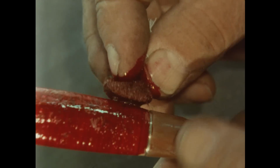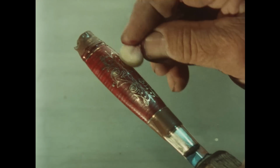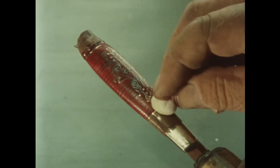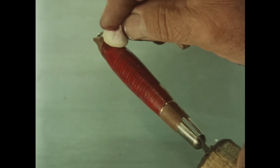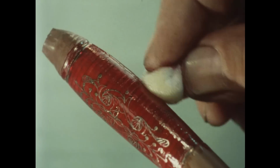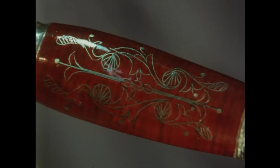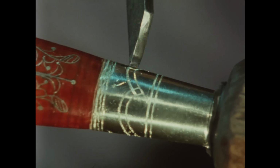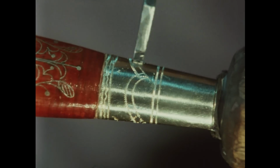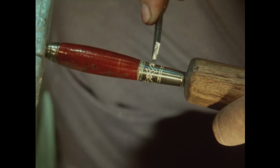Because the figure is a little higher, it is easy to file it up after colour varnishing without damaging the bark surface. The varnish makes the handle fine-looking and protects it from dirt and moisture. The decorative figures can be clearly seen on the varnished handle. Engraving is done freehand. The pattern is individual in the first place because the engraving tools are homemade. The decoration can even tell whose workmanship the sheath knife is.